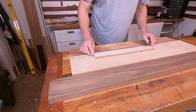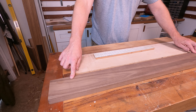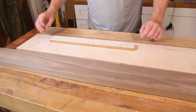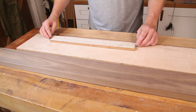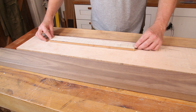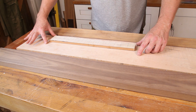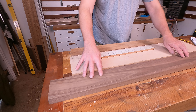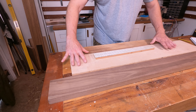I still need to maintain the laminate structure without cutting through from the walnut into the maple when I introduce the taper for the fretboard. I need to ensure that the four centre sections are about 30-ish mil and then the two outer sections will make up the rest. So basically it works out as: a veneer down the centre at less than a mil, two 10 mil strips of walnut, two 6 mil strips of maple giving about 32 millimetres, and then two 14 mil sections of walnut. That ensures I won't cut through the outer walnut into the maple, so the stripes on the neck will be consistent right the way through.